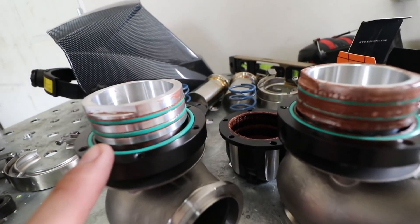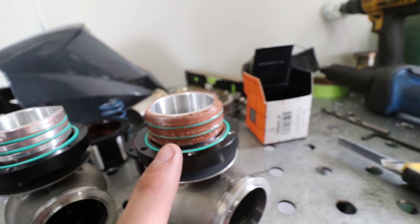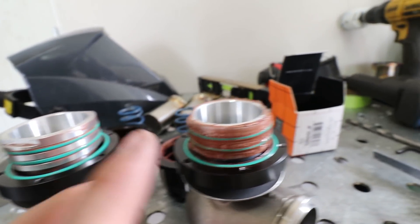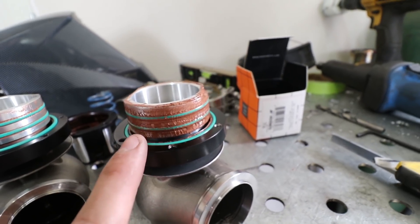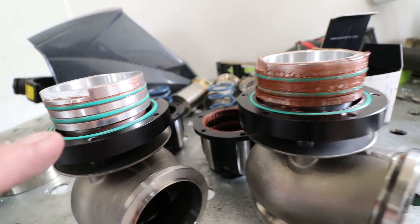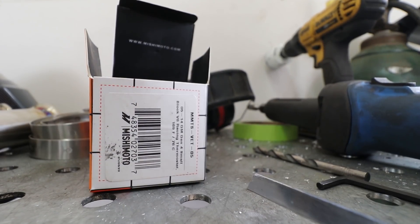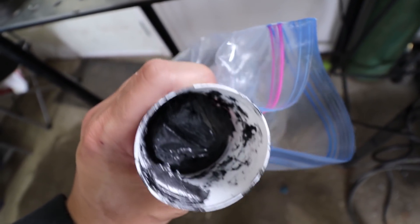Because it's an o-ring style and not a diaphragm style, you do have to lube the o-rings. This is the old lube that we were using. The new lube is actually a darker gray and it's got a higher temperature rating than this stuff, which is why we went with it. That's kind of cleaned off — I'm going to clean both of these off and then put the new stuff on. I can't actually show you who manufactures it, but this is the color of the new stuff.